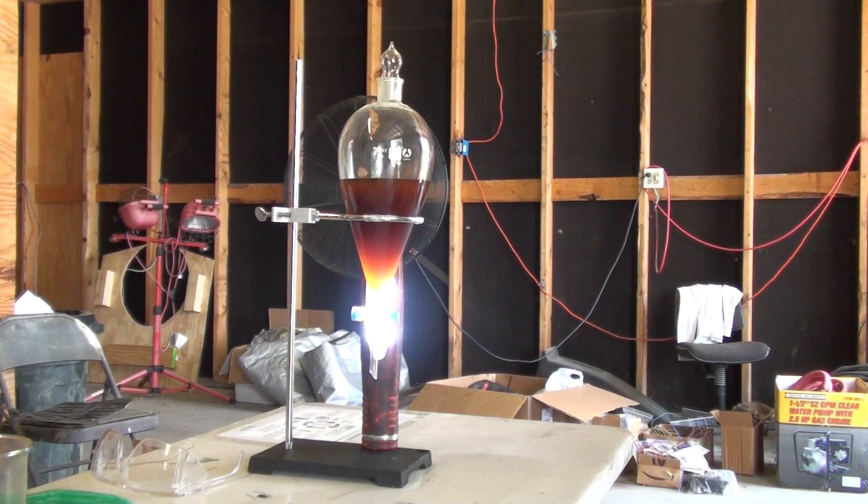So we peaked at about 90 PSI. Sounds like we need to go back to the other plates. Now that we've ballparked it at 90, we can go back in and use the one that was at 150 and see what it does with this lower viscosity.